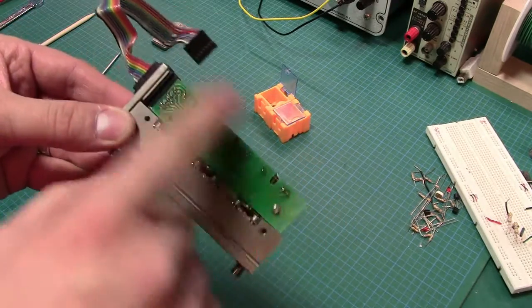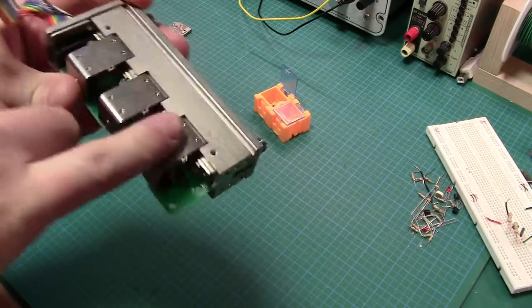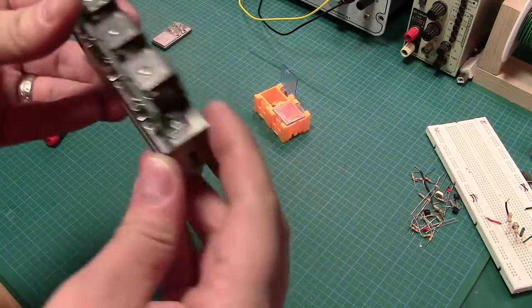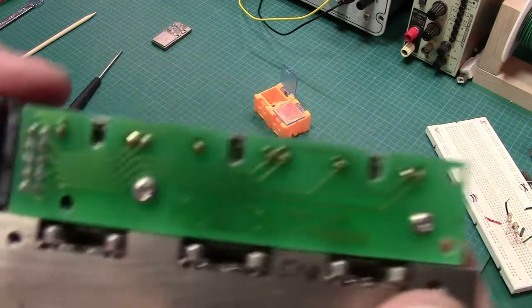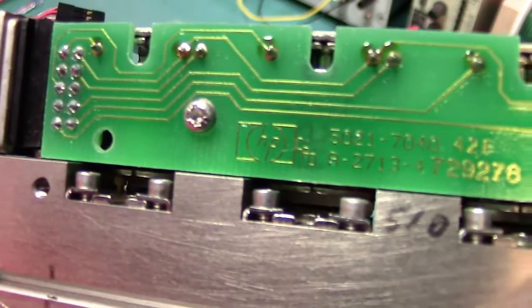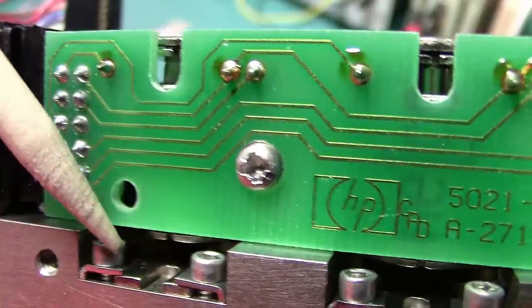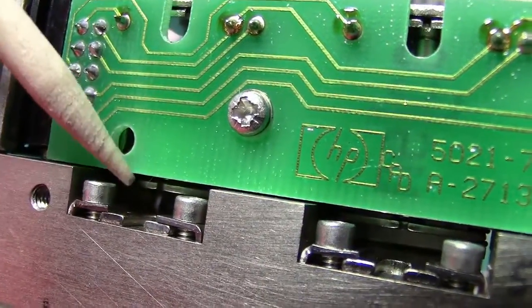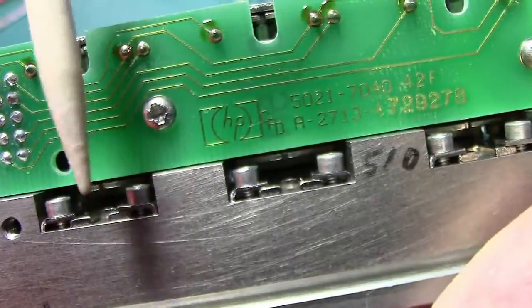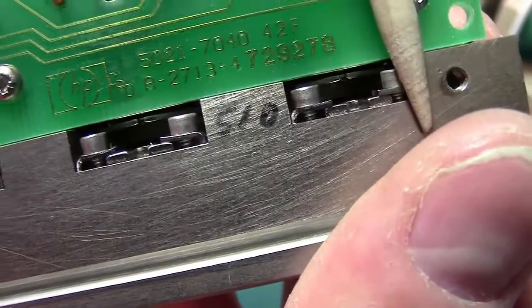We have a little circuit board here, which is nothing major, just to reroute some of the signals. It's sort of hard to see, but you can see the solenoids are right here. We've got 3 of them, 1 for each pad. It's really difficult, but we might be able to see it right there. Where's my, there we go. If you look in there, there's a plunger in there. The solenoid will actuate in and out like this, and there are 2 plungers, one on each side of the attenuator pad. And we'll see this when we pull apart the actual RF pathway.